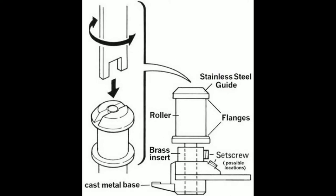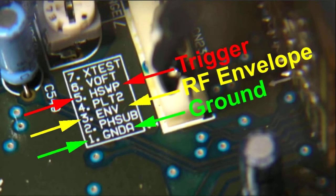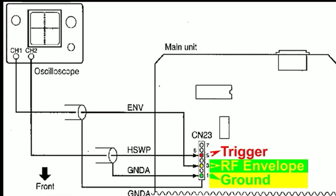Unlike Sony's tape guides, the Pioneer guides have no locking screws, so it's easier to get started. The test points are on a header, rerouted to the rear panel for ease of connection, either for monitoring with the lid on or calibration.